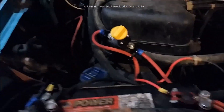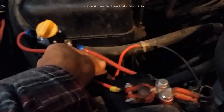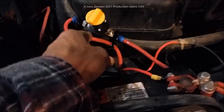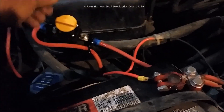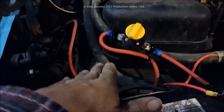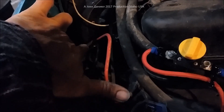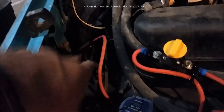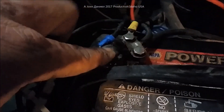We've gone ahead and got our wiring done using number four wire, going to a 250-amp switch that is mounted to disconnect the system. It runs through a fire-resistant poly tube that they use in motorhomes — run all the way underneath and back up to keep the wires protected and strapped up in the frame. Over here we have the same thing: four-gauge wire grounded to the battery.